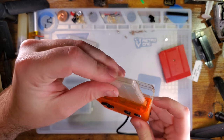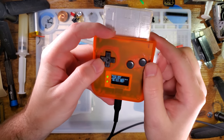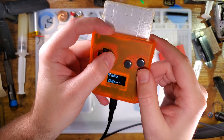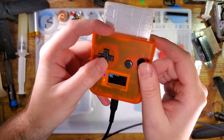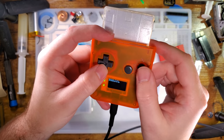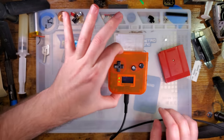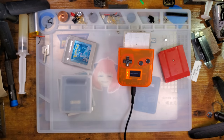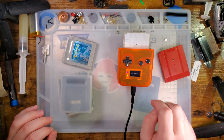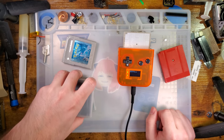We're just going to hot swap it because I don't care if it wipes. So 29F Cart MBC3 — might fail, might have to reboot it, probably won't, but we'll see. I'm going to go ahead and flash Pokémon Silver to it and set that down. For context, GBX Cart can do this in about two minutes — I expect this to take probably eight to ten. In the meantime I can go ahead and talk about something else.